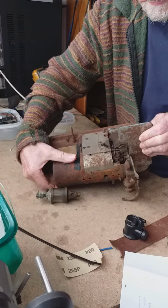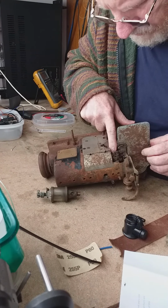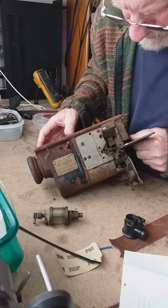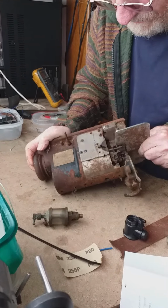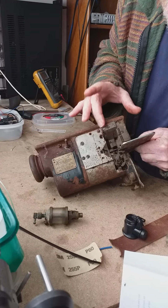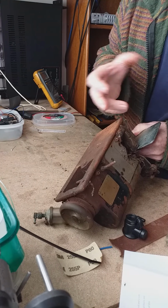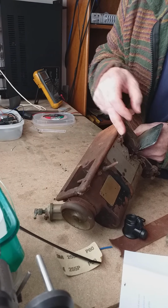Now we can see over here, there are varying lifters here. You probably can't see them there because I can't move the machine. These are typical in sewing machines, to lift or loop the thread. And here is your take up, which is in the lower position. And I'll put it there, you can see it there. That is what takes up, on a normal sewing machine, it pulls up your stitch. Because this is jammed, you can't move this at the moment.